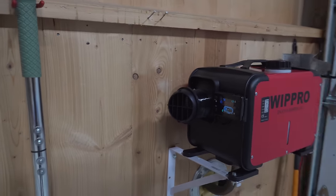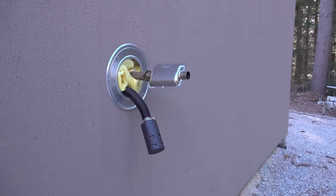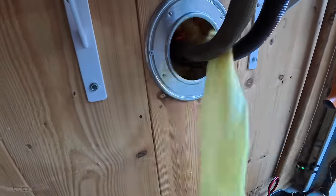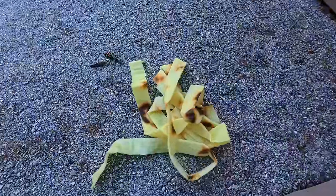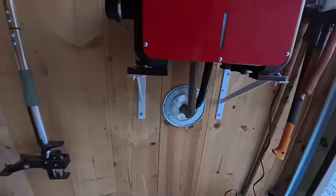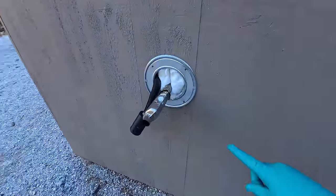To be fair, this room is empty with a huge echo, and you can hear how loud that tick is — but keep watching because this unit eventually becomes silent. Before I got that far, I started smelling something, so I stopped the unit and took a look at the insulation. Despite having the wrap all over the exhaust pipe, the regular foam insulation was still burning up. So to anyone thinking about using this stuff on a regular installation — don't. You'll want to use a fireproof product like ceramic insulation used in boilers and wood stoves. It's designed for ultra-high heat and will not burn from any contact with an exhaust pipe.